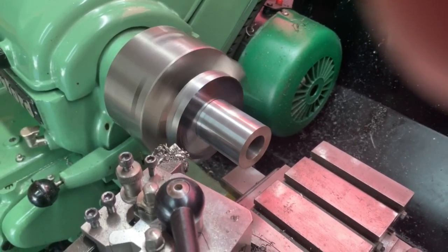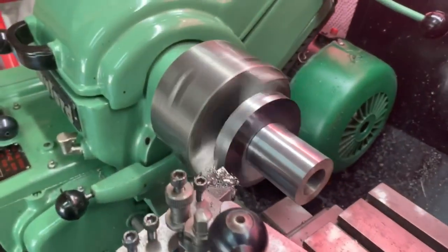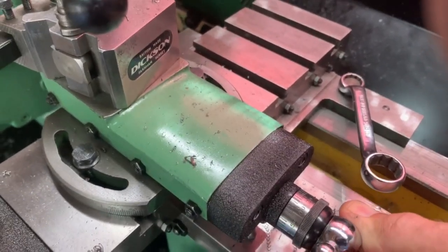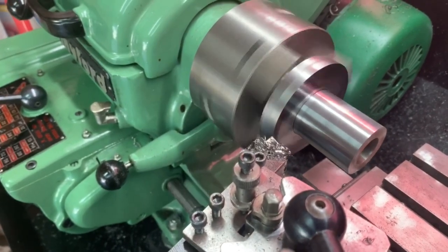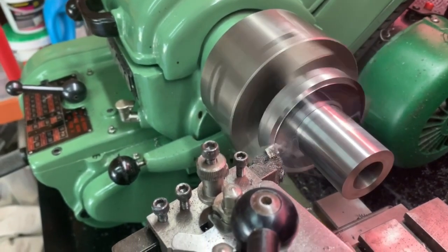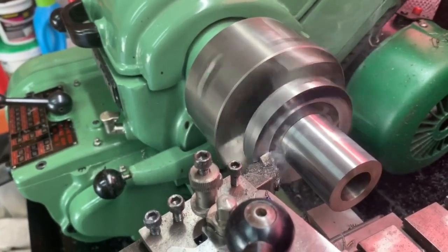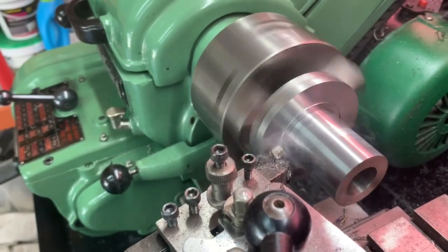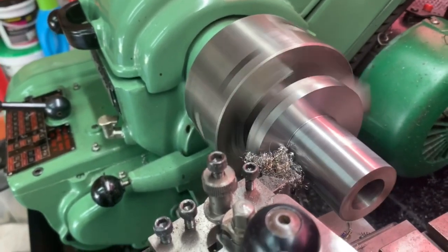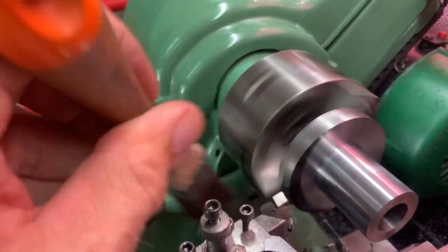We're now ready to do the end plate. The way I do this is first I lock the carriage down, then I wind in a few thou and basically just do a forward cut from there. You can see it's skipping on the metal because it's a little bit out of true having been welded on. I wind it down and do that until I get to the required size. There's a lot of smoke — that's got a little bit of oil on there. Don't take it right to the end — I'll do a finishing cut at the very end. Using my trusty brush to clean the swarf so I can see what I'm doing.